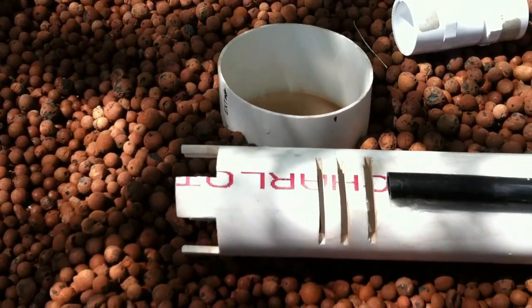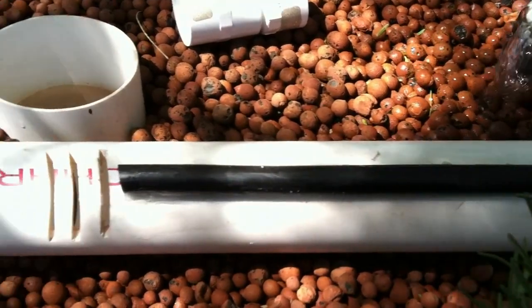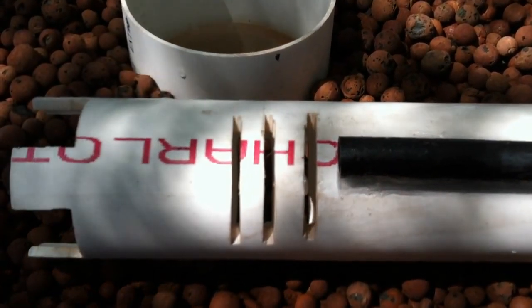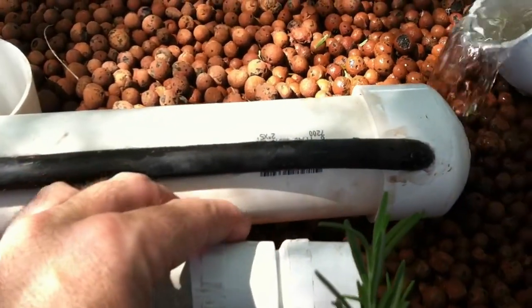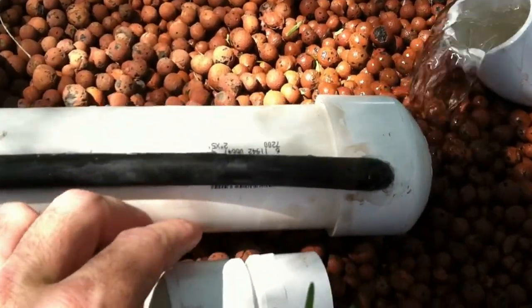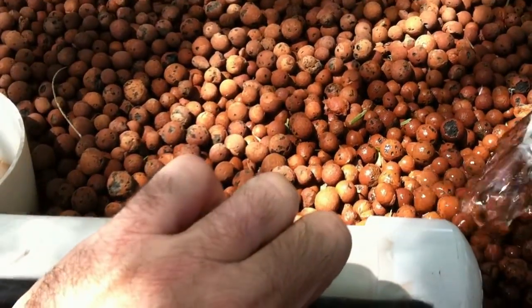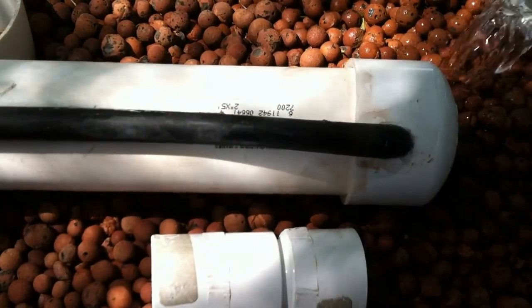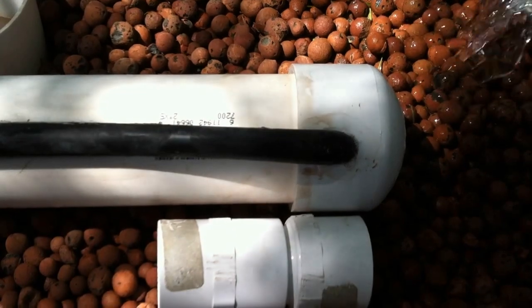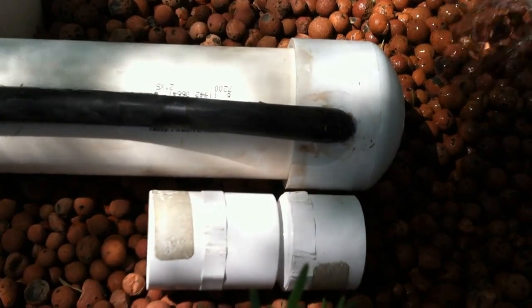If your system is not shutting off like it should, you may need to either insert a tube if you haven't, cut that tube about a quarter of an inch above the slit, or make sure the tube is at a proper height above the standpipe. The proper height should be where the bottom of this cap meets the top of where your standpipe would be. If your tube sits down too far on top of your standpipe, there's not enough air in there to break the siphon, and the siphon is going to continue to cycle.